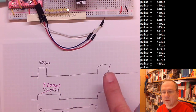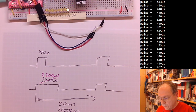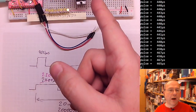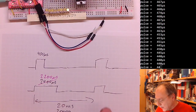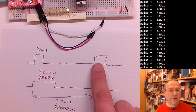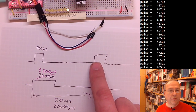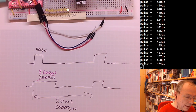If the repetition stops, then after a short time, the motor will leave the control loop and will be freewheeling or idling. And then you could turn it. So the idea is that it should continuously get this pulse train telling the motor at which position it should be sitting or standing.